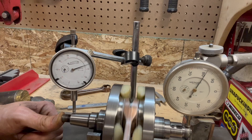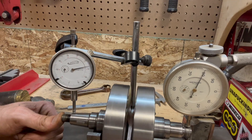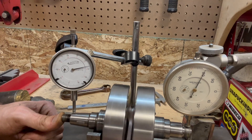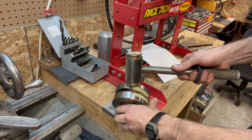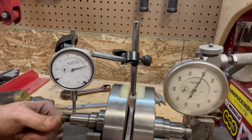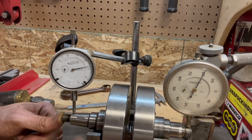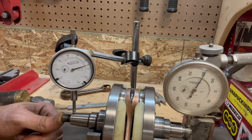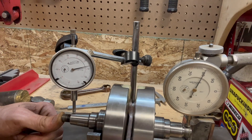I've moved my indicators around a little bit. I've got the crank really close, and I've moved the right side indicator off onto the threads — I'm not too concerned about that anymore, just keeping it there for a general idea. I'm looking at the left side, which I've moved onto the tapered section, and I'm putting a little bit of light pressure on the crank just to hold it in place so it doesn't walk around. I've still got about 3 thou to go. The movement of the crank doesn't directly correlate with how hard you hit it — cranks will stick, and then once you hit them hard enough they'll jerk and go too far. At the end of the day, it's important to narrow it down to two things: you're either going to be out on your swing, or the webs are not going to be parallel. Those are the only two things you can adjust.